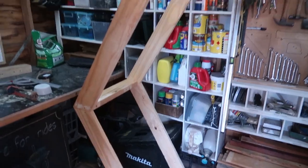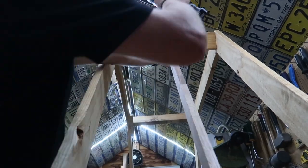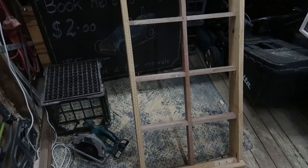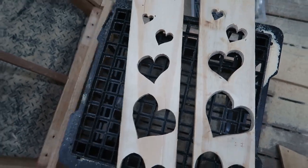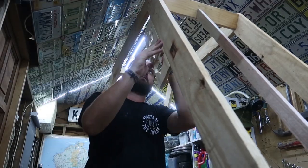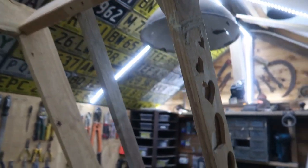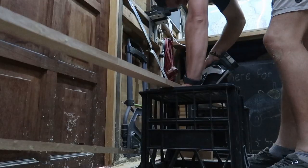The bracing is finished - this will be the front. Next I'm going to use this timber to fill the space all around. I've completed three of the five sides, and before going further I had an idea: put some hearts on the sides. I've cut them out of a piece of timber and then cut that timber in half, so I've got two. I'm going to put one up here and one right here. I'll cut the frame so they sit flush, then a bit of glue, some screws, and a bit of putty. Let that dry, give it a sand, and I think it'll be pretty good.